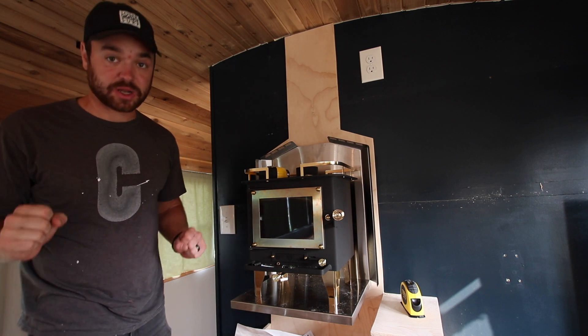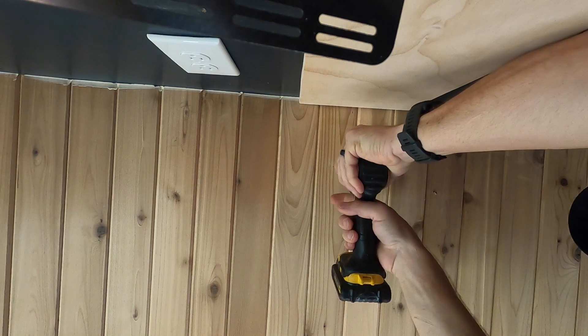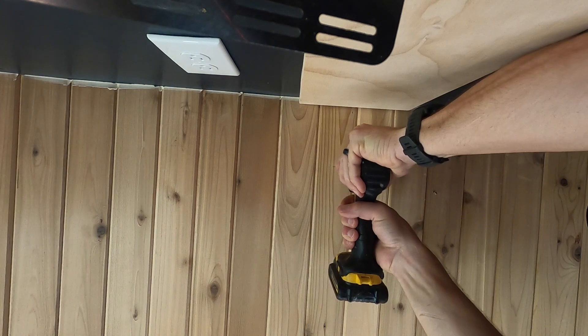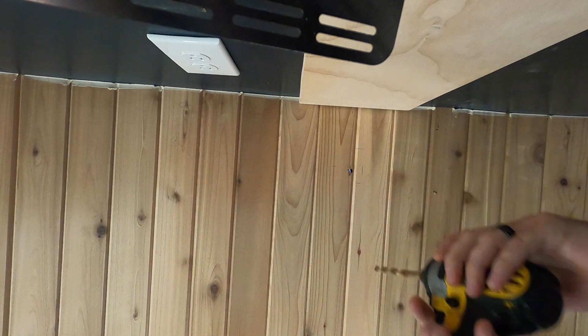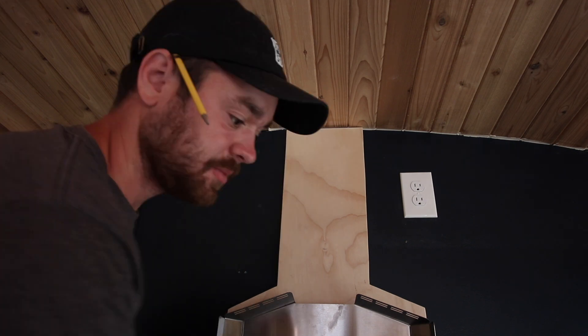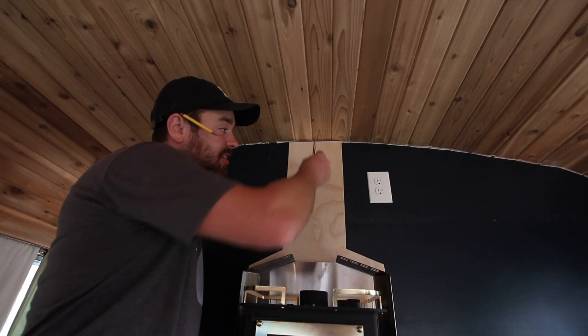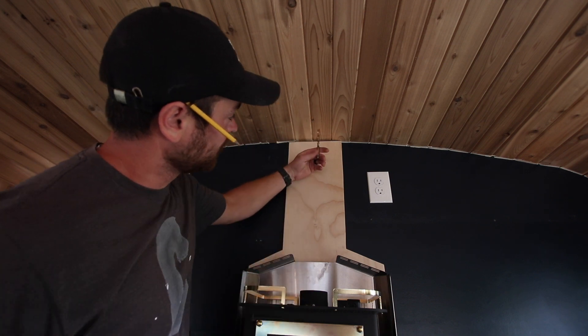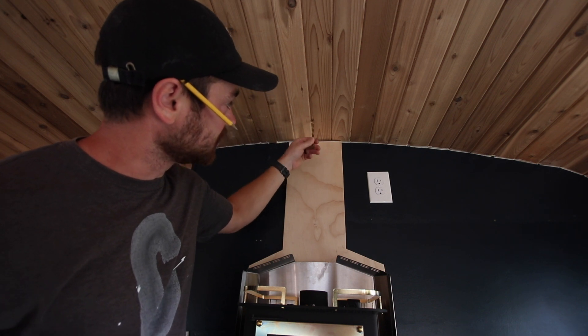This is what I'm most nervous about. I'm up to the roof. We have a hole in the ceiling — we have light through the hole. It's scary. When drilling up through the ceiling, you want to make sure your bit is straight up and down, because if you go crooked you'll come out two inches off to the side on your roof.